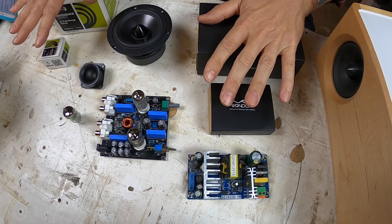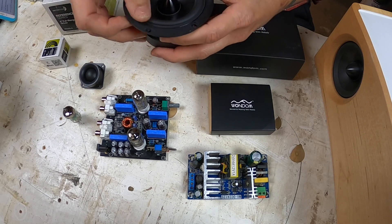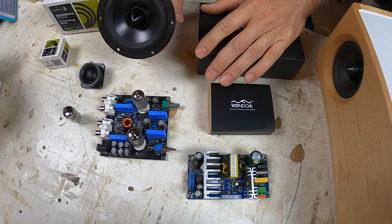Now let's go to my favorite part — driver selection and amplifier components. We have the Dayton Audio RS100 4-ohm full-range driver: metal frame, aluminum cone, and rubber suspension. I started this project with the PS95, which is a great driver with good highs — I didn't even need tweeters. But I wanted more power and bass, so I moved to the RS100. That gave me more power and bass but not the highs, which is why I added the Dayton Audio ND20FB neodymium three-quarter tweeters — rear-mounted with a back plate for inside attachment.